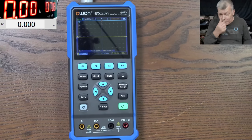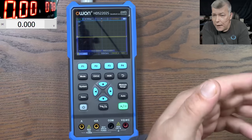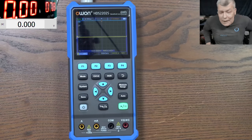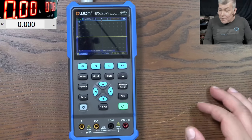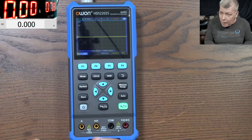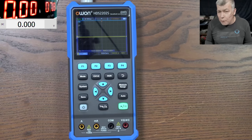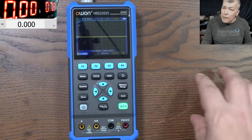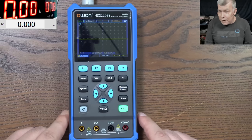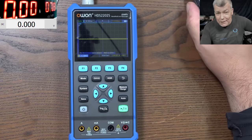That's my latest tool — this one was missing from my workshop. The main reason I bought it is for chipset diagnosis. Even if the chipset is reading the BIOS but the laptop still won't start, that can indicate a corrupt BIOS — if the BIOS is corrupt, the chipset may still read it. We can figure that out when we have motherboard repairs. You can also check communication between the Super I/O and the chipset. Very versatile. I'll stop here — hopefully you enjoyed this video. Thank you for watching, like and subscribe, and see you on the next one!